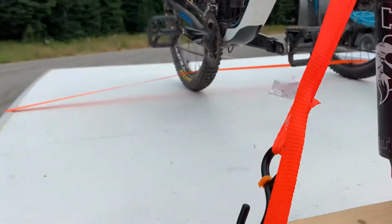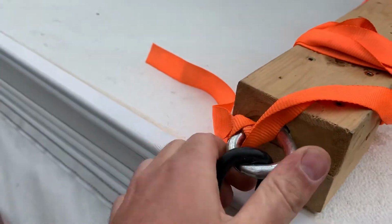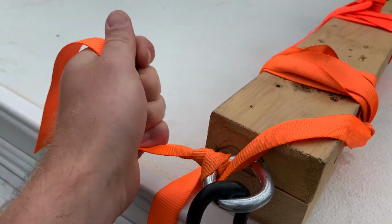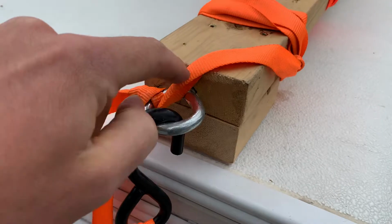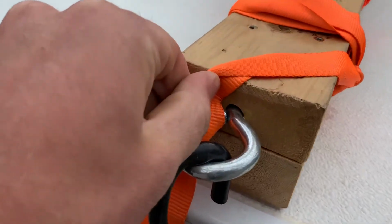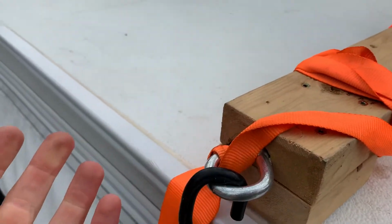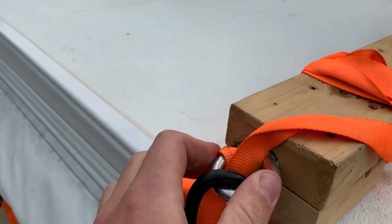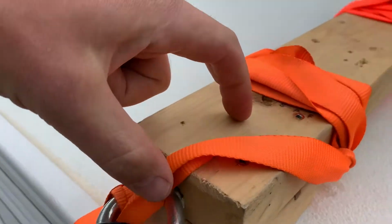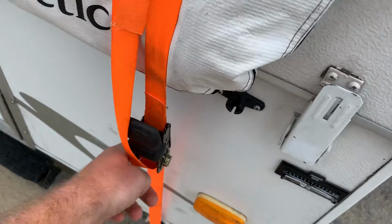from rocking. Now, at the ends, I put really, really large eye screws. They're not eyelet bolts, eyelet screws. Basically, they are a round circle with a large lag screw end. So I put large ones here. Again, I pre-drilled it and I glued it with some contractor's adhesive. Probably not necessary, but I just wanted to make sure these were really strong. Pre-drill it, screw these in. I think they go in about that far, and that makes it so we can put our tie-down straps.